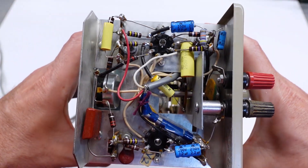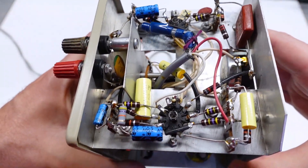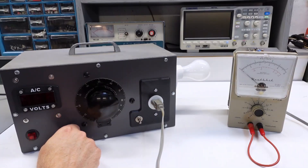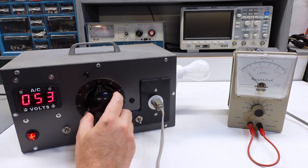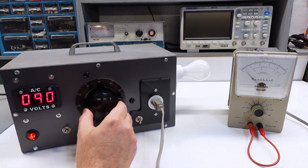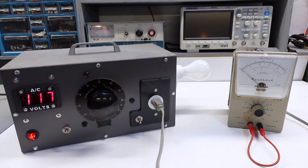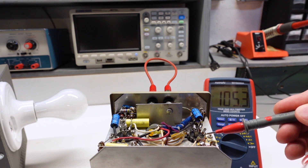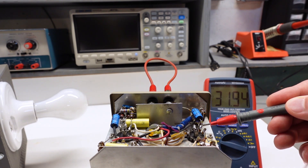Flipping it over, let's look at the tube connections. In this area you can see most of the other electrolytics, film caps, and a few resistors that I replaced. Whenever I replace caps, I try to position them so it's easy to read the value and the voltage rating — though I did forget to do that for one of them. With the new components all swapped in and the two tubes reinserted, it's time to do a quick power-on test using my dim bulb tester. Good news — no magic smoke, and the meter needle is showing some response.